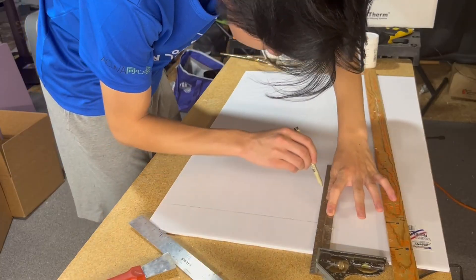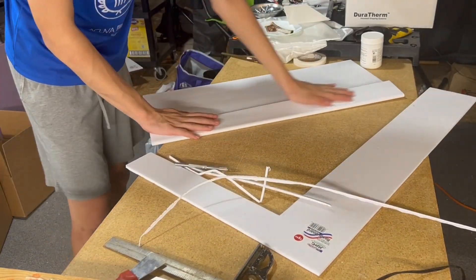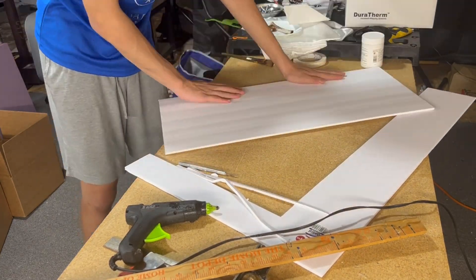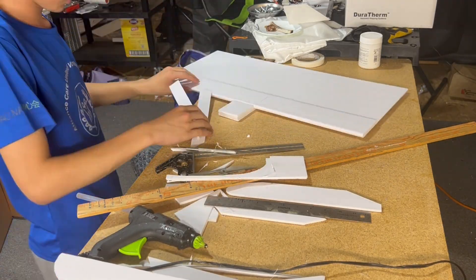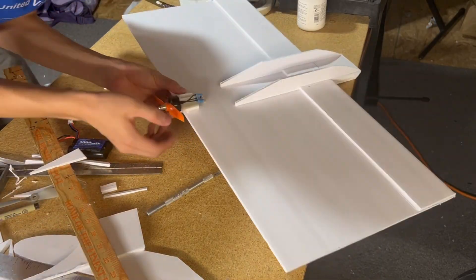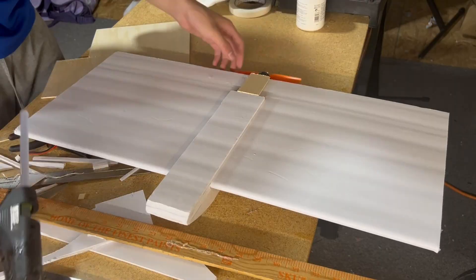With all that said, it's time to build. I started by measuring and cutting out a simple rectangle, then I folded the front to create a step on the leading edge of the wing, also known as a KF airfoil. The wing had a wingspan of 27 inches and a chord length of 12 inches. After that I added the walls of the body pod. I ended up needing to extend the nose since the motor was in the back, which made the whole thing very hard to balance. Due to the fact the motor mount was just attached to some foam board, I strengthened it using some wood sticks and boards.